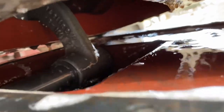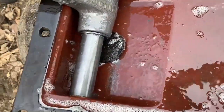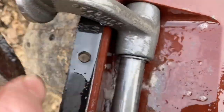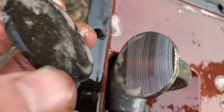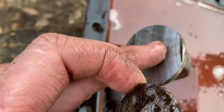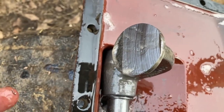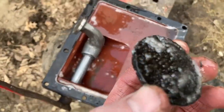Right away I see our problem. Here's the disc that's supposed to be on the actual brake — it came apart. We can see what's going on: this was trying to stop the clutch from spinning, but obviously there's no brake on it. So that was our problem.